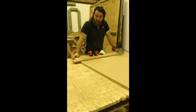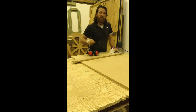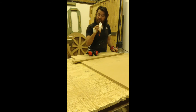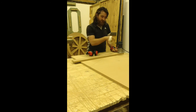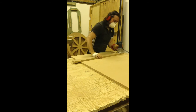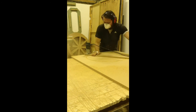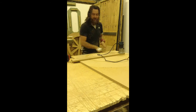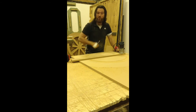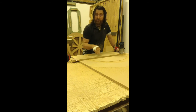Now we are ready to cut our circle. We have the router bit just a few millimetres over the surface from the bottom — that allows us just to make a dent to begin with in the material. As I've mentioned many times, this creates a lot of dust, so make sure you use your dust mask and your ear defenders, because you're about to find out it's very noisy. Here we go! Now you can see we have an ever so slight circle formed. Now that we've made that little indent, it's time to get deeper and deeper with the router until we can get the deepest we can possibly get.